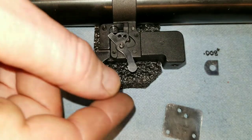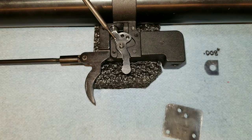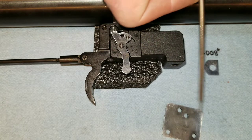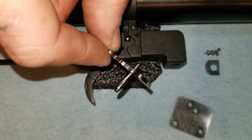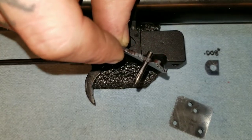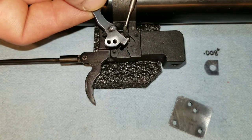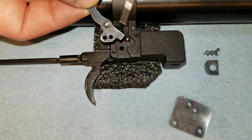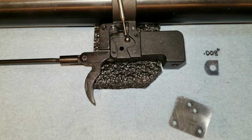I also quickly took that same finishing paper and did a sand job on the side of the safety lever — I didn't sand the bottom side, just polished this up a little bit since it's going to be riding on this plate when going back and forth. This will just slip up and out of there. The post here is fixed into it and shouldn't move. I'm going to set that to the side. All this stuff in here was completely packed full of grease — grease everywhere — so I had to wipe down all these pieces and clean them up. Now you can see the detent ball sitting right up on top of the spring below it.